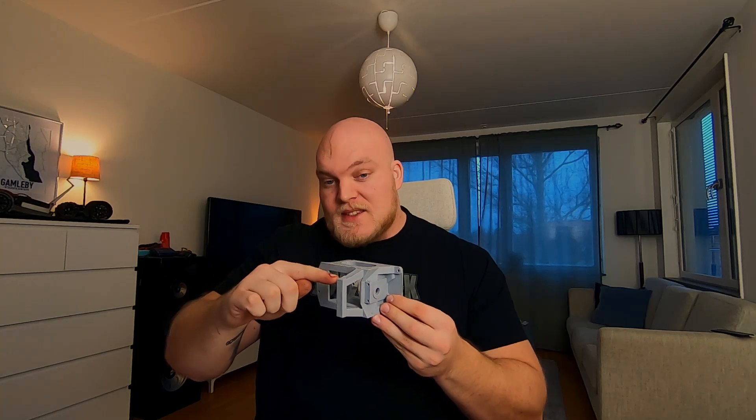However, the first one I printed, I printed in this direction with the layers like this. What ended up happening was I broke the mount for the bodywork off. This is the replacement for the part I moved back that I mount the body on — that's why I had the car taken apart today and I took the opportunity to make this video for you. Now, instead of having the part printed like this, I laid it down like this, so I still keep the strength in the layers from front to back, and I also get the strength up in this part. The strength sideways doesn't really matter that much because the bodywork of the car is holding sideways together. So now I will put on a time-lapse when I mount this and the car will be all done and you will see how it looked like.